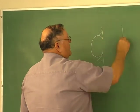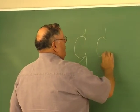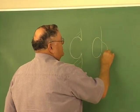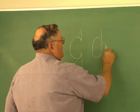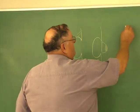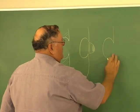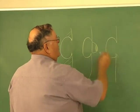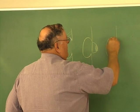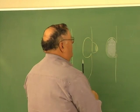And let me draw this again. And we've sized our eye to the hole so that the eye will actually go into the hole. Now that we've sized the eye and the hole, we're going to fill the hole, or the cavity if you will, with epoxy bedding compound. And I like to use the Quickwood brand, 5 and 20 minute.